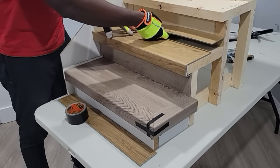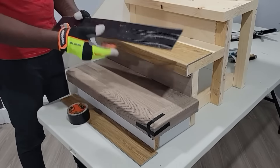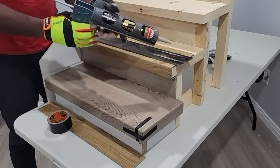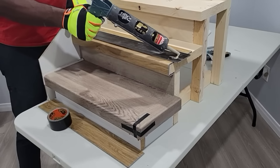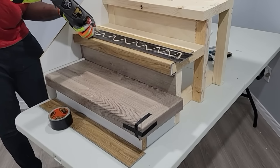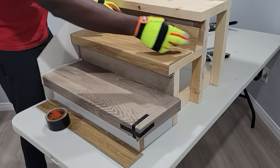You can wait and do this back piece afterwards. The key here is not only to get it tight to the piece that was just put on, but also to make sure that the height is the exact same because they are not clicking together. You don't want to end up with any ridging or variation in that. You also don't want to put the adhesive too close to the edges or else it's going to squish out when you go to put it in place. So you can see here we're doing a nice line down the middle and we're going to get this put into place nice and tight.